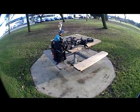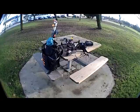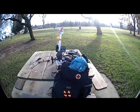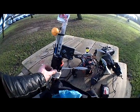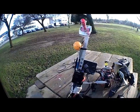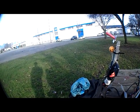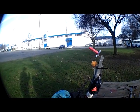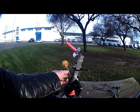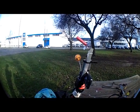Okay, well here we are, and I forgot the chip for the hoverbot, so I'm going to have to use this out of the camera. But here's the antenna setup. We've got the antenna there, we've got the computer here today, so we're going to record the in-flight data and see which one is better when I'm switching between the 2 antennas. We've got quite a bit of room here to fly, so we'll check altitude as well. We've got the skew planar, and we've got my helical 7-turn there. Let's see how it works.